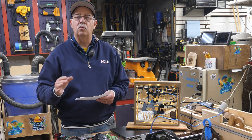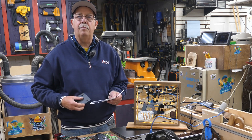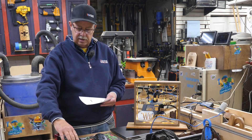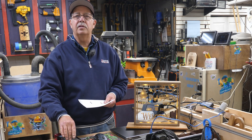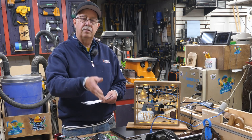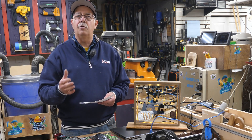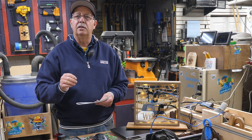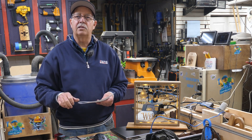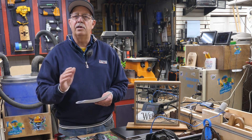So how important is that precision? What are you doing — are you engraving on jewelry, or are you doing something like these slate coasters? The power relationship is not linear between 5, 10, and 20 watt. If you have a 20 watt laser and move to the 10 watt, it is not exactly half. Going from 10 watt to 5 watt, it's not exactly half either, nor exactly a quarter of what a 20 watt would be. It is not linear — you need to run your own tests.